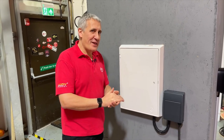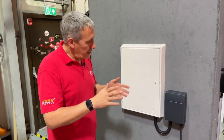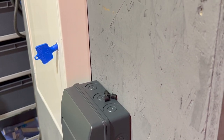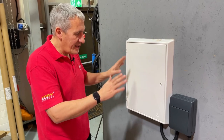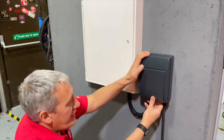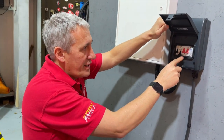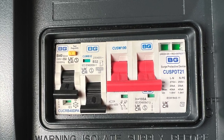It's almost fitted itself — pretty neat installation. The consumer unit has a similar profile to the meter box, and a lot of meter boxes are now painted to match the property, so it'll almost blend in on the side of the house. Let's have a closer look at the consumer unit itself. It's a robust design — inside we can see the gasket that helps achieve the IP65 rating, and there are options on the circuit protection.